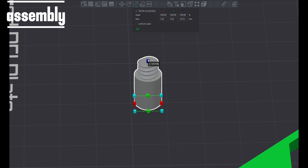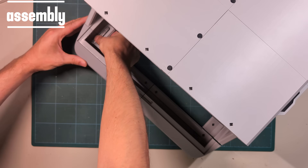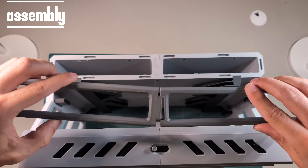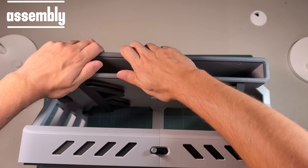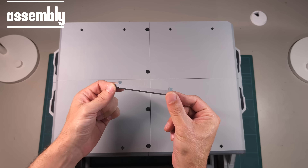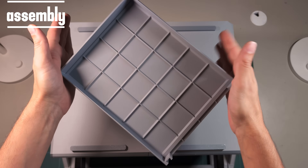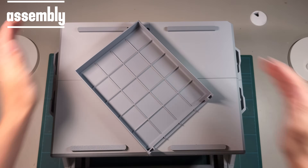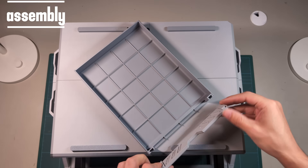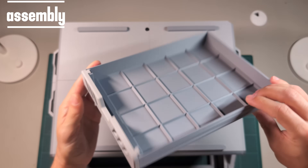Do the same on the knobs so the threads go in easy. To lock the front in place, you need three connectors. For the drawers, two front pieces with knobs can just be pressed in. If your printer shakes a lot, you'll need four limiters to keep the AMS in place. I really like that there is Gridfinity integrated in the drawer, and you install the front piece with the notch up.